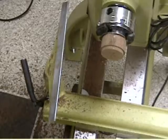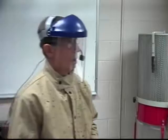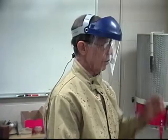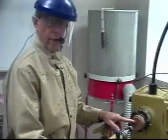So on the very top, if you looked at the table over there, the top has either the gold or the silver disc, and that's an inch and a half. And what they do is they drill that a quarter inch deep. That leaves room for the cover to snap in a little bit. And again, that depth doesn't make a lot of difference if you go over or a little bit below, because it's just that cover and it's fairly shallow. But you want to make sure you're on the top of the pepper mill, not the middle part.